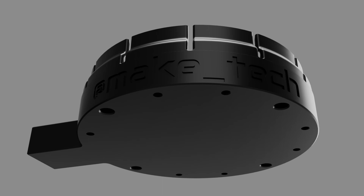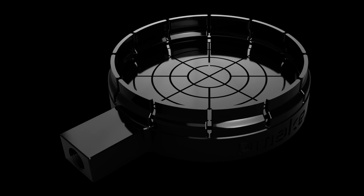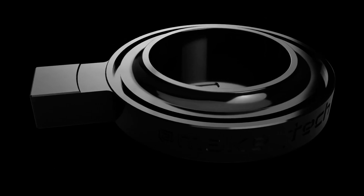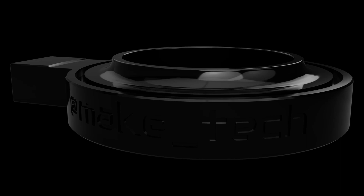Let's take a look at these CAD renders. The first one is a self-centering sprung-loaded collet-style device designed for round stock that's just been straight cut. Then the next two units have 3D features specific for the parts that were being produced.